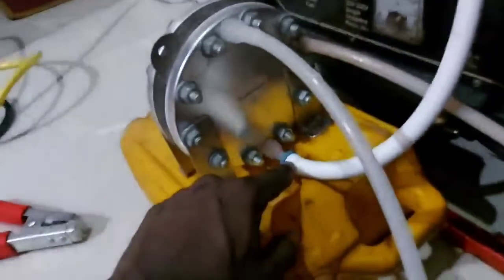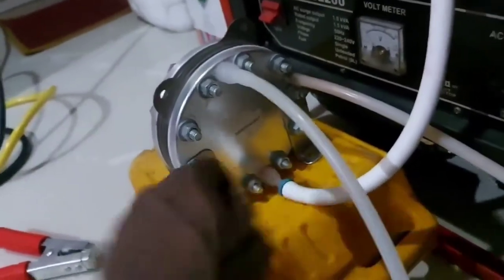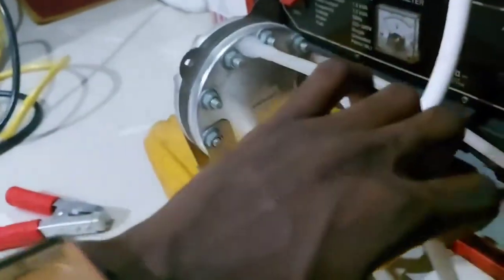And I control the distilled water coming into the water input on the electrolyzer, and that's the water input over there. And unused distilled water comes out with oxygen through the pipe at the top. So I'm going to find a way to fix that back into the distilled water tank itself, because the water there is pure enough to go back into the distilled water tank.